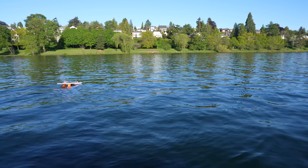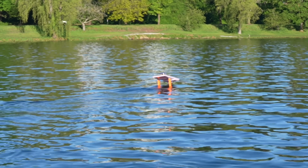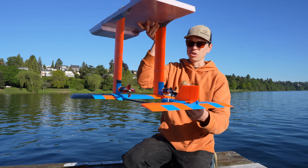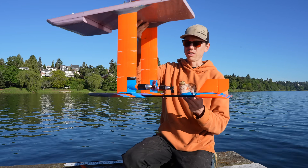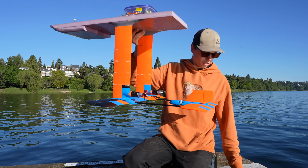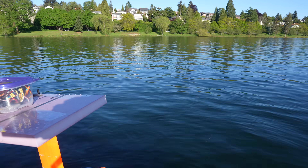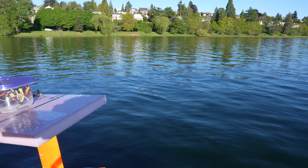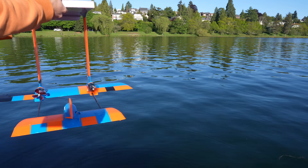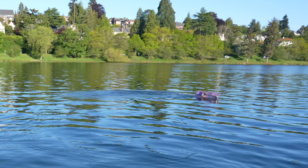These are ailevators — or really elevons on the wing. They kind of control pitch. The next experiment is to see if I can get away with no aileron control — only differential throttle controlling yaw — and hoping that will also carry over to a little bit of roll control as well. The ailerons and rudder are completely unplugged. It almost works before it completely falls over. When it's sideways like this, my elevator becomes the rudder.